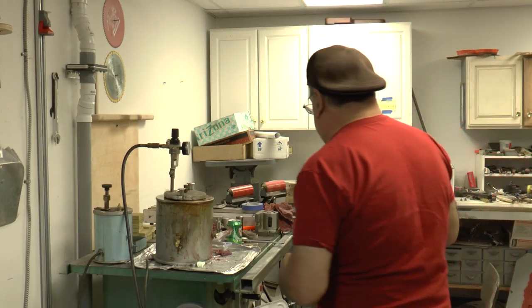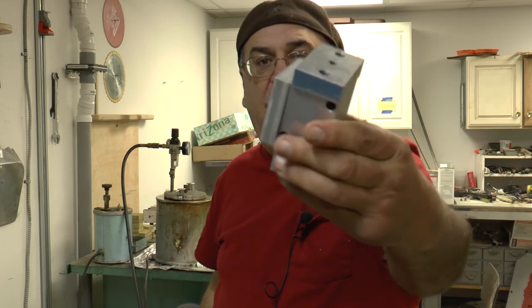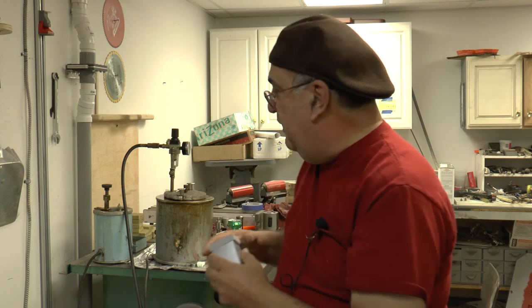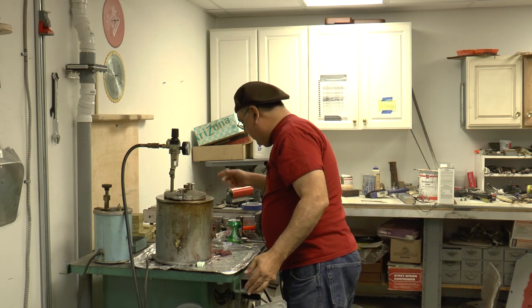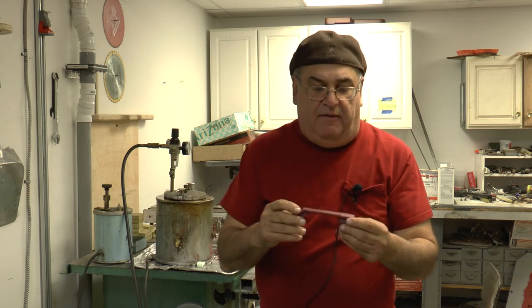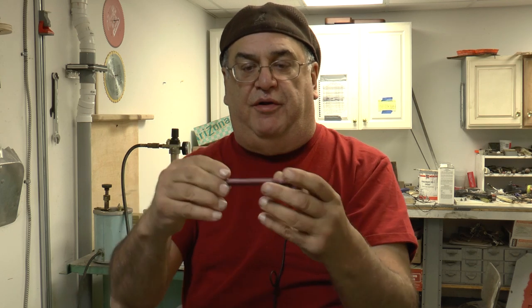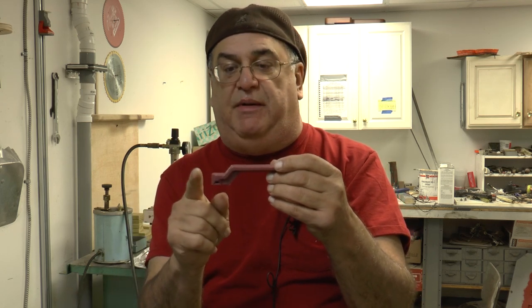And that has an aluminum mold, which we'll show you in a little while. This is the aluminum mold here. And that gets it a little bit more accurate than the rubber mold. And I make the nuts, I make all kinds of different stuff. Now this one, this is a brake hanger that I made up for the Mikado. But what I'm gonna do, and this is a nice part about this though, I need a longer one for a Pacific. It needs to be another half an inch or so longer.